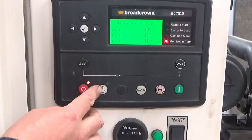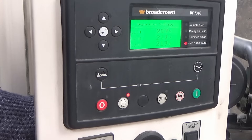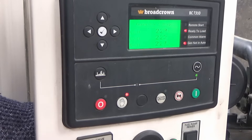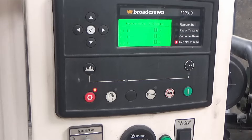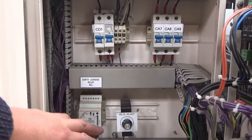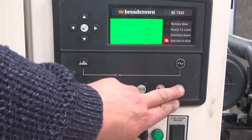Let's put it into manual mode and start it. Almost there - it didn't reach 240 volts until I turned the internal adjuster almost all the way to the right. I think the other potentiometer might need adjusting slightly, so I'll tweak that a little bit and try again.